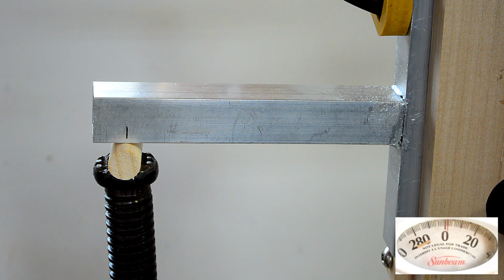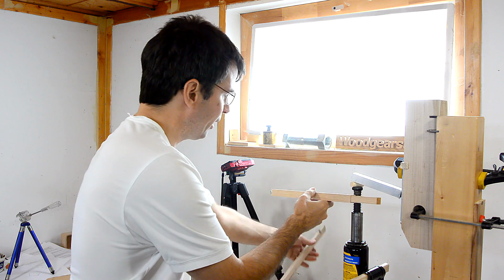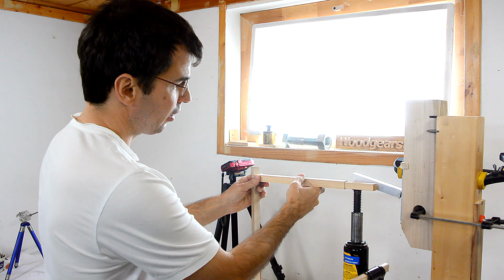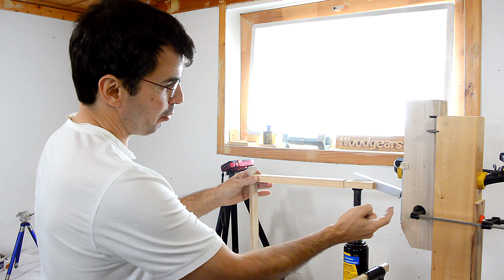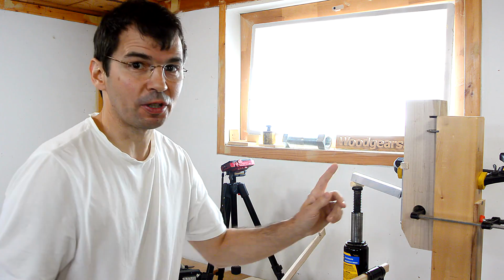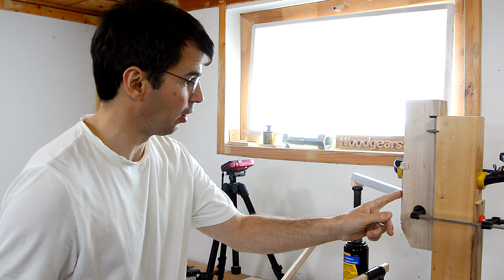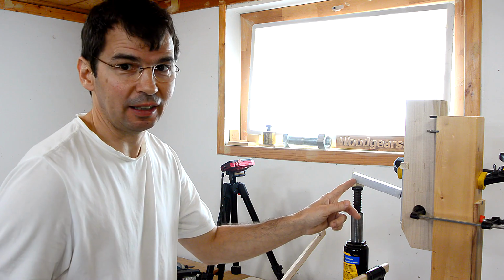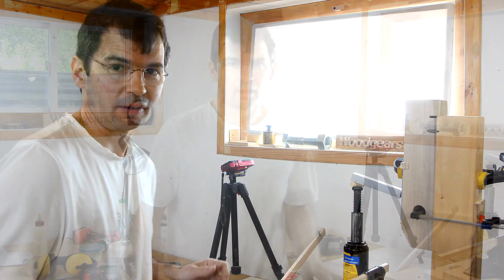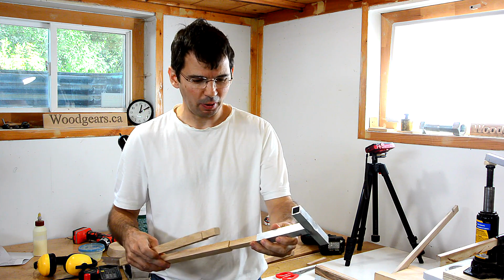And remember, this is actual force, not 5 times force as before. Even if you adjust for the fact that this lever arrangement here took up some of the up force that was applied here, perhaps as much as 5% of it, I still had over 600 pounds of shear force applied here before the previous one broke, whereas applying the force here, I didn't even get up to 40 pounds before it broke.